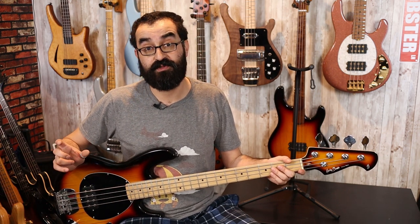This now has the preamp fully installed and functional. This preamp is around $60 and is the higher end preamp of the ToneMonster line, versus the SBK series which we looked at with the SUV bass. This is also a much hotter preamp — it has an adjustable gain on the preamp module itself, and I had to turn that down quite a bit because this thing is spicy. The original preamp does come with a balance knob; I removed that and wired the pickup in parallel straight to the preamp.